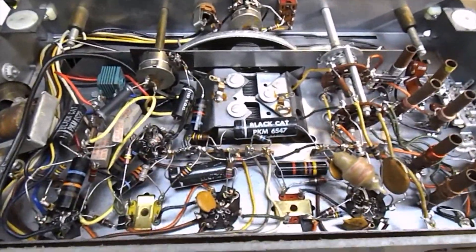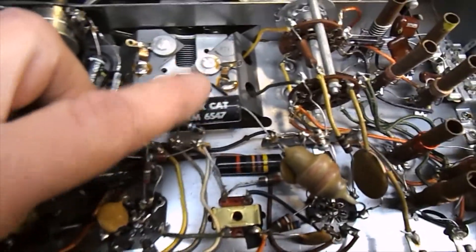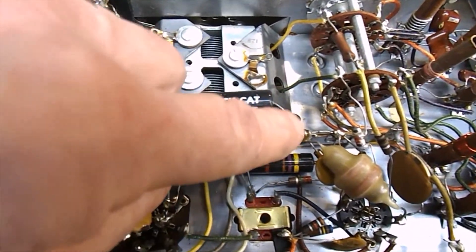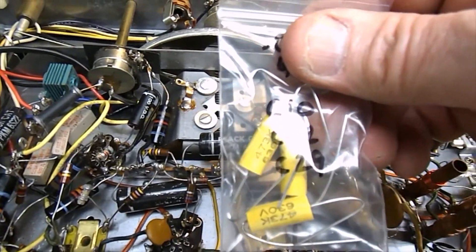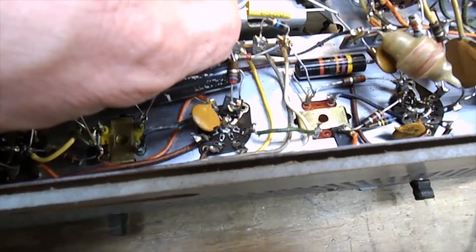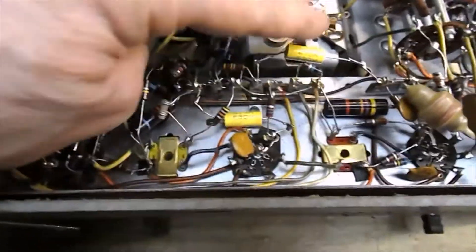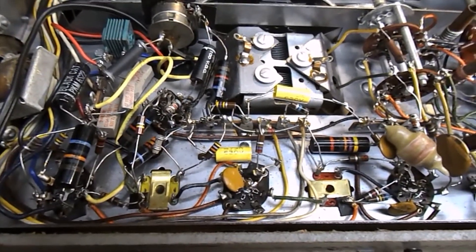Now I'm going to start changing the capacitors. Since I'm not used to doing this I'll start with a big one first — this one is a 0.047 microfarad and it goes from pin 7 of the 12BE6 to ground. I'm going to leave the leads in there coming up and put the new one around those leads. I got the first one in loosely, made a physical connection, squeezed them together, then made a solder connection and cut off the excess. I made a loop, crushed them down together — a double loop pressed together — then soldered, so you have both the mechanical and the electrical connection.